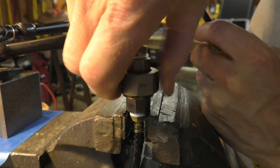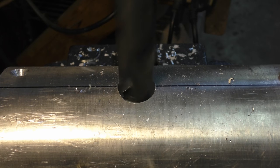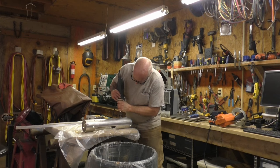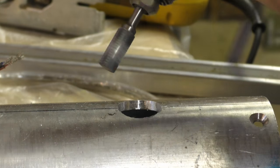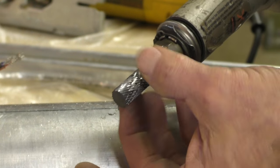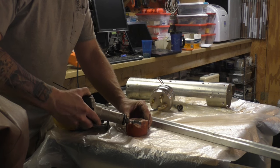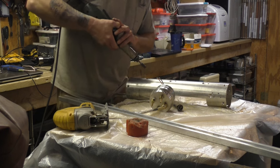I think that's going to do fine — this is one of those things that a mill is going to be nice to have. I just put this in and it's kind of an indicator. I should have waxed that because it's gumming up with the aluminum. You can do fancy stuff with just an old candle. The worst thing is if you have to weld after you do this because of the wax.